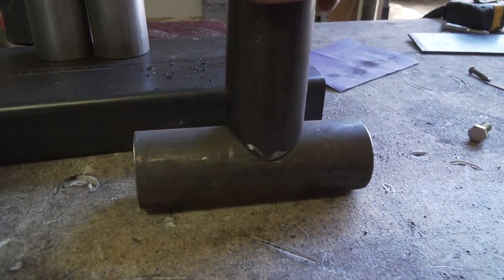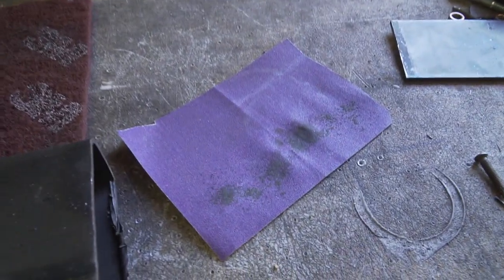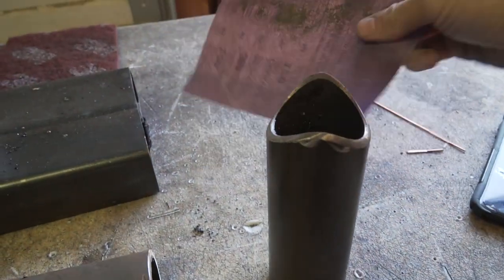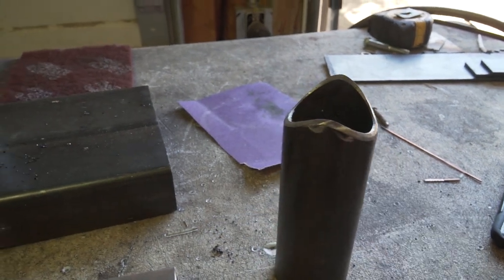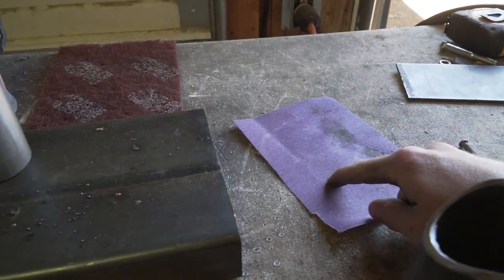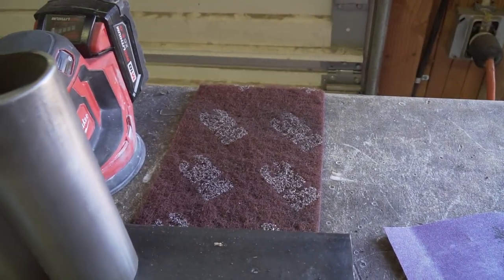What you want to do is once you have your tube prepped and ready to weld, before you tack this onto the truck or car, take some 120 grit sandpaper, wrap it around here, spin it a couple times, get this mill scale off the tubing. Then take some Scotchbrite and clean it up to get the heavy scratch marks out left by the sandpaper. The reason I use both instead of just Scotchbrite is because the sandpaper will eat the mill scale off real quick and then you can clean it up easily with just Scotchbrite. If you have a lathe, you can chuck it up and just rub Scotchbrite against it, but for garage use I just use sandpaper and Scotchbrite by hand.